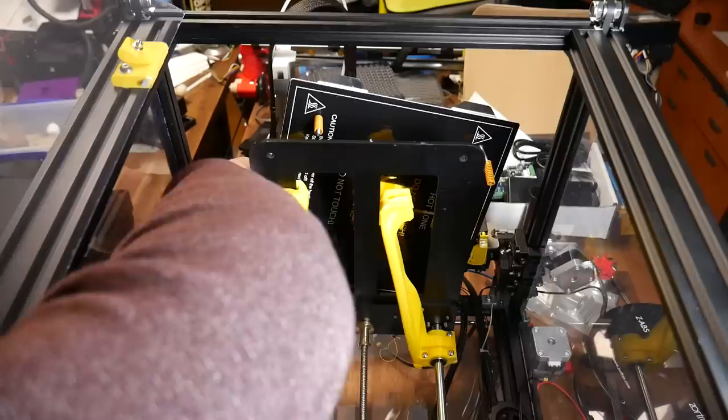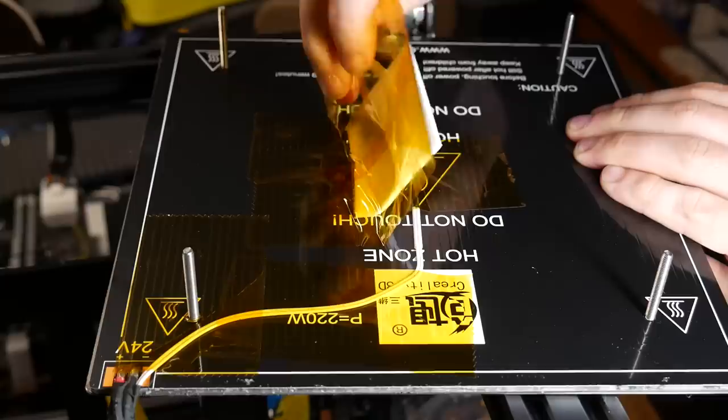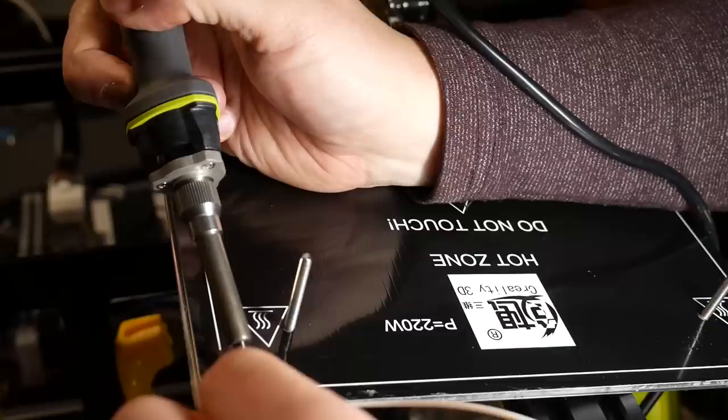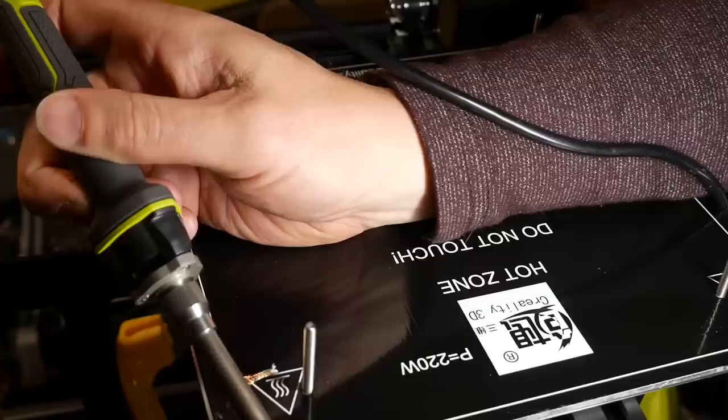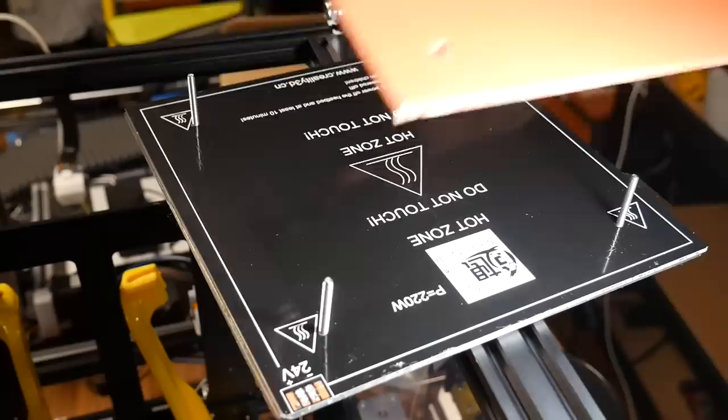Physical installation is pretty straightforward. We start by removing the thumb levelling screws on the bottom of the printer. Once all four are out of the way, it's simply a matter of lifting the bed clear. In the corner, the power wires are soldered to the stock board and the thermistor is taped to the centre, so we start by peeling off the Kapton tape holding it down. We want a completely bare surface to stick our new silicon heater to, so remove all the Kapton tape and lift the thermistor out of the way. I like things to be reversible, so I got out a soldering iron, melted the solder, and removed the power wires. I then used some solder braid to remove any chunks of solder left over.